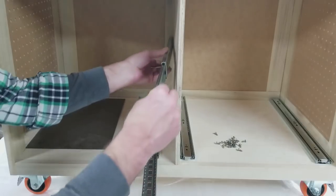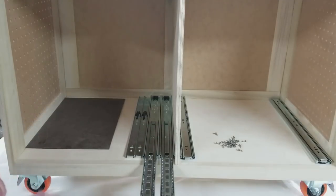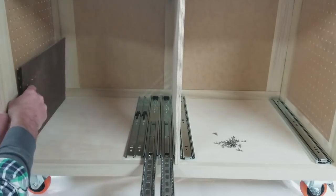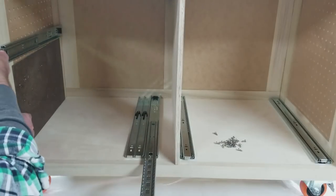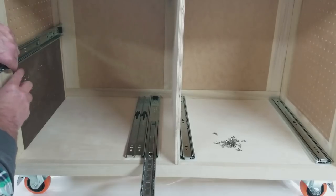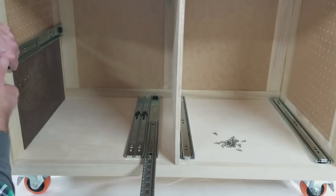These mid-level drawers, or trays, are 9 1/2 inches up from the bottom. So I use a trick that I got from the editors of Woodsmith, which is I cut a spacer 9 1/2 inches wide. I can lay it against the side of the cabinet, rest the drawer slide on top of that, and fasten it to the side of the cabinet. And I can do the same thing for the other 3 drawers, and I know they're all exactly level and all exactly the same height.